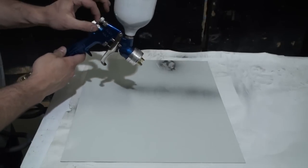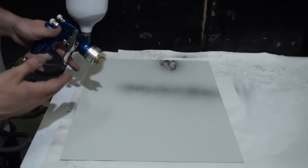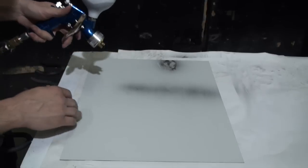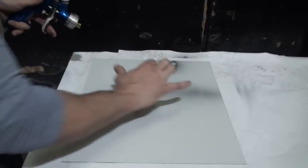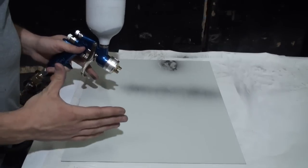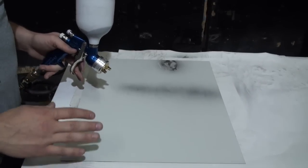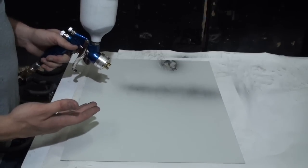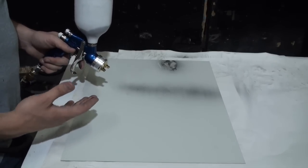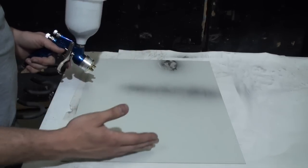This is actually looking pretty good. Be aware that the more paint you have coming out, the faster you can — and should — move your gun. With less paint, move a little slower. I personally like to go a little quicker, so I'll let out more paint. I've got quite a large fan pattern here; I'm going to turn it down just slightly to get a bit higher concentration. With acrylics you don't really want a lot of concentration, so I'm only turning it down very slightly. For other paints — enamels, lacquers, urethanes — you need to build up a reasonably wet coat, so you'd turn down your fan more to get a higher concentration and allow more paint to flow out at once.